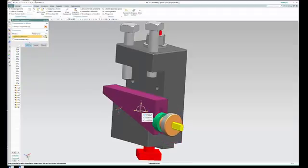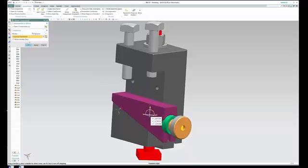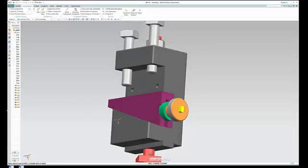and the washer and this adjusting nut should move with it, and they should all move along that adjusting screw in unison. I don't care where you place that otherwise, but that should move together. Now the piece down here at the bottom, that should not move. It should be centered on that hole, obviously.